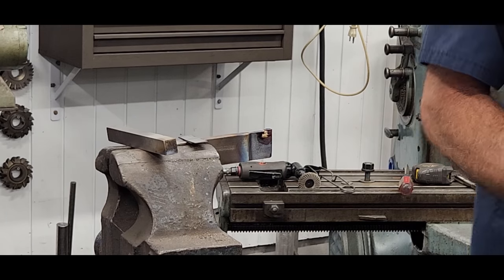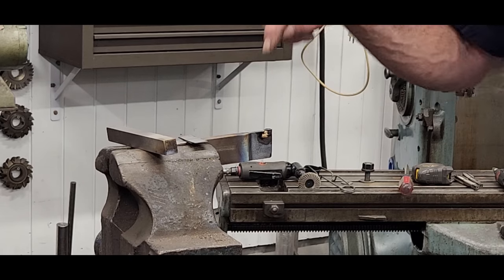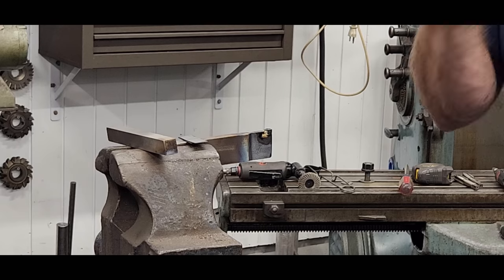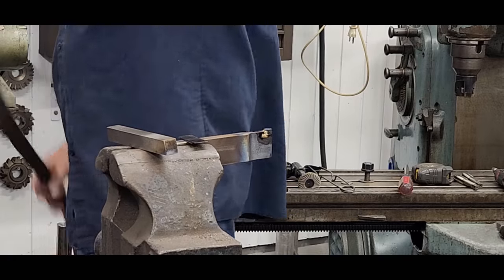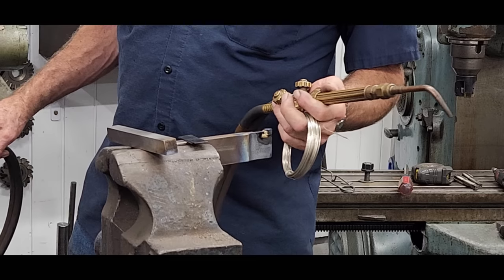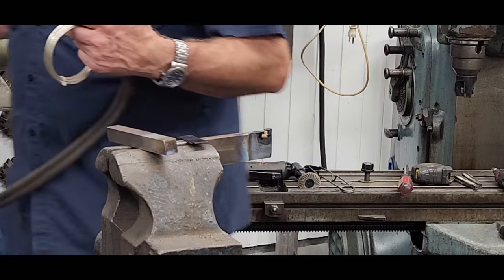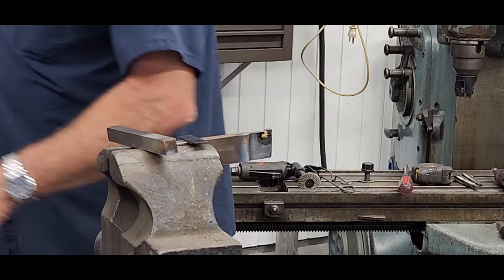That expense right there probably took me no more than total about 30 minutes from start to finish. Alright, and this holder will last, unless you crash it. I'm not saying if you crash it you're gonna lose it, but this holder should last that 10 box insert. And it just takes you 2 seconds to float that off after you've chipped up the carbide, or it becomes brittle or cracks or breaks, or you crashed it, and clean it up, and then prep it, and then set and silver solder the next one on there. Silver solder is just a liquid fastener.